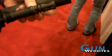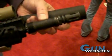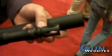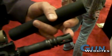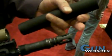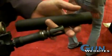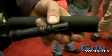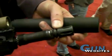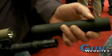So this is a shroud over the barrel. It's a shroud over the barrel, and it fits around any barrel. There will be certain collars that will have a certain diameter to work around the barrel diameter of the customer. And the nicest part about this suppressor is that it will actually take any flash hider that's on the market. You can use a Vortex, a Phantom flash hider, or any of the A1, A2, M16, or compensators, like PWS compensators or anything, as long as it's no larger than 22 millimeter in diameter, which is standard, and as long as it's no longer than a Phantom or a Vortex, they'll fit inside the suppressor and work